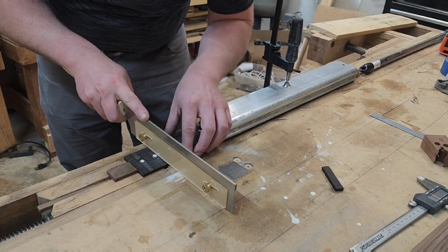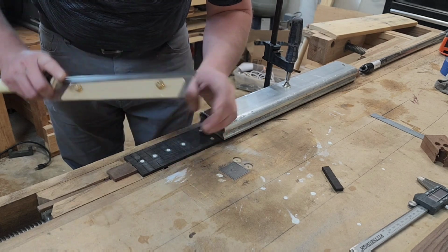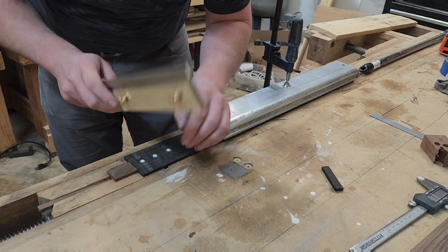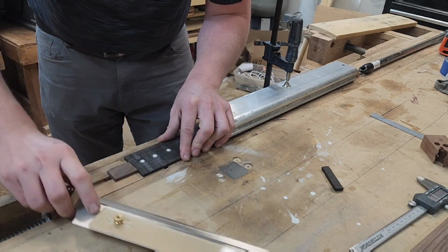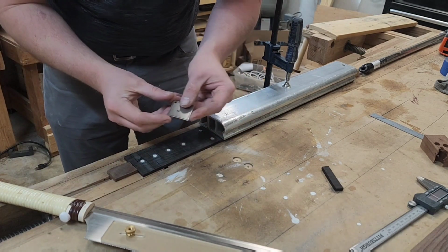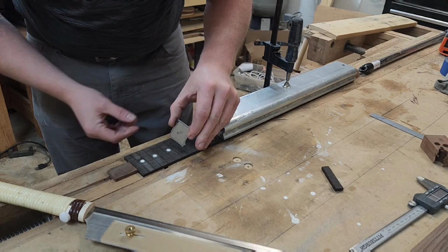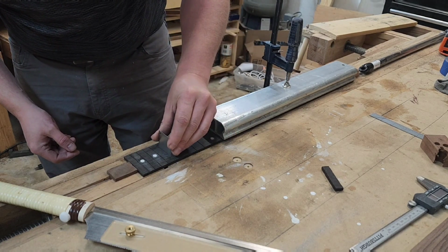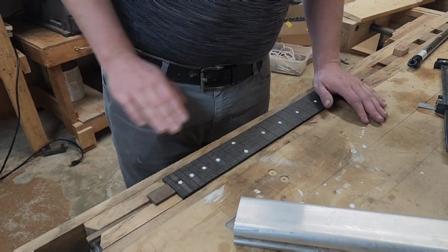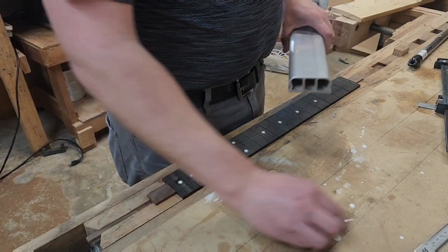It's just a matter of going through with the saw. The saw is very sharp, but it takes a very small amount of material at a time. Just a matter of going through every single slot with the saw, checking with the depth gauge to see that each slot is deep enough to accept the fret tang. That frustrating process actually took about half an hour to do.